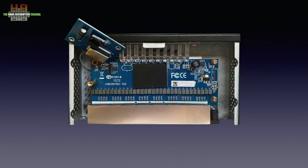When we look inside, we see that directly behind the power socket there is some power regulation. Here we see the network sockets from the top with directly behind it 4 inductors per socket. A network cable has 8 strands that per pair carries a signal. The inductors are to filter out nasties from these signals. Behind these filters, 32 small transformers that provide galvanic separation on the 8 network ports. Under this metal plate, the microprocessor is hidden. I presume the metal is for heat dissipation.